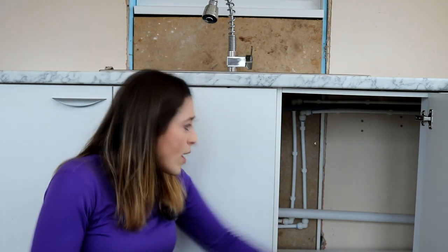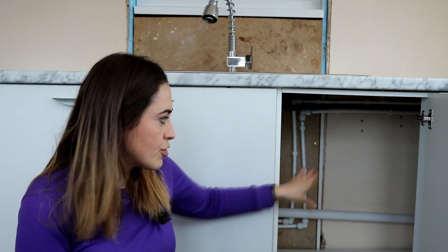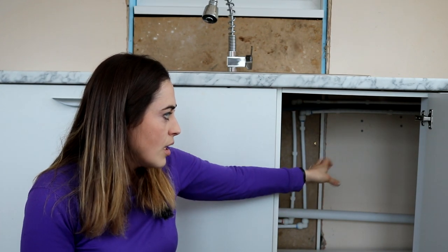So that's it for this one. If you do anything differently, feel free to comment below and hopefully it will help other people. The other thing is this waste pipe - I can't get it to be flat against the wall to fit the clips. They're sticking out a little bit too much because I fitted the water first. So what would you do? I'm tempted to use some scrap pieces of wood, fit them to the wall, and then fit the waste pipe to that. But if you've got a tidier option, I'd love to know.